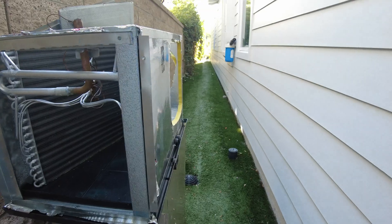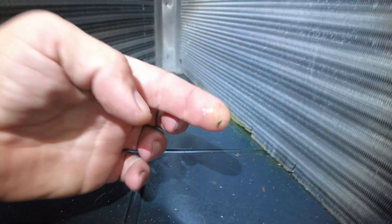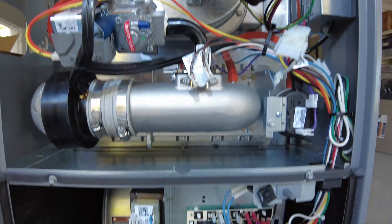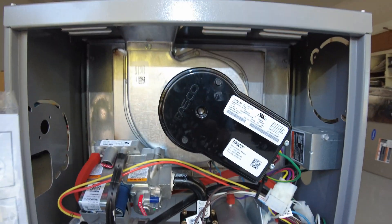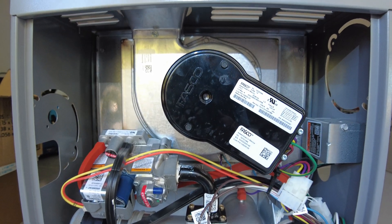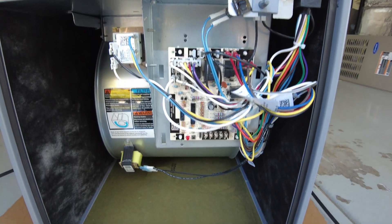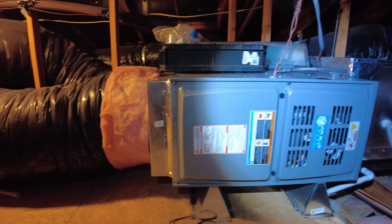Let me show you how it's set up in the attic. This particular system had a refrigerant leak — you can see oil residue inside the pan, which is where it was leaking, usually somewhere in the bottom. This is the new furnace with an ECM blower motor — a high-efficiency, five-speed blower motor. This furnace is made by Allied, a Lennox International company, and we will use it as a two-stage air handler: 70 percent airflow in first stage and 100 percent airflow in high stage.